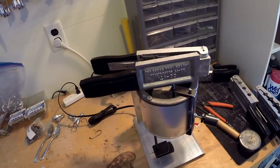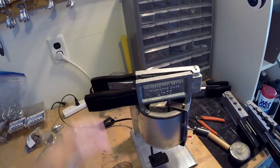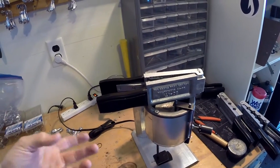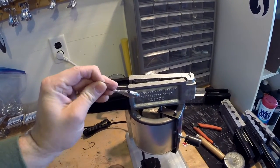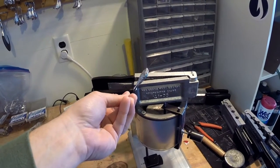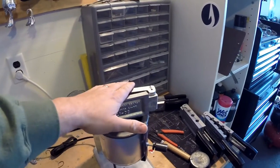While the pot is warming up and starting to melt the lead, which takes about 20 to 25 minutes, I put some of my jigs on top of it. This warms up the interior - you want it pretty warm so the lead does not stick and you don't get crappy pours. Yesterday it wasn't warmed up enough, and you can see how the jig missed the bottom. So I'm going to remelt those and let it warm up a bit more before I pour.